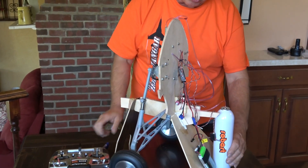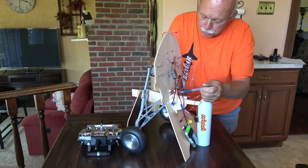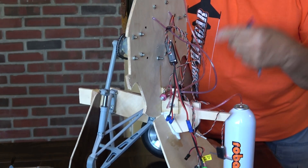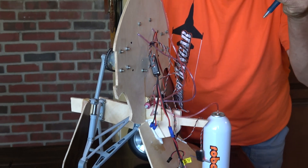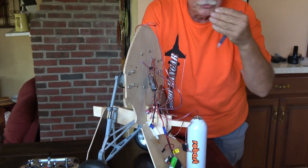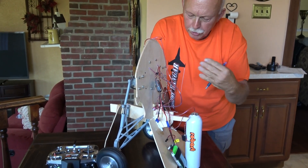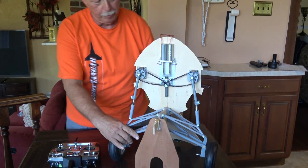Back here, the regulator is one of the main things. You've got to get this regulator set just right. All the way out or all the way in is not the answer. You need to set it with a servo — the servo controls how far you go in and how far it comes out. Not just full throws; plus you need to adjust the air pressures to get them retracting equally.